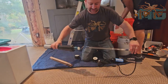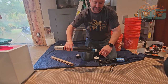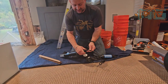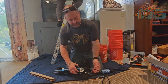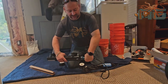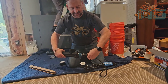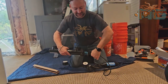We're going to go ahead and stab it into the ballast, and then gently put it into the sleeve. Now there is a nut on top of here that has a seal around it that gives you more or less slack, so you want to loosen that up and tighten it onto the already taped threads. Get a nice tight connection there, slide this back down, tighten this back on. That way the cord isn't pulling the bulb in and out and it's nice and secure in there.